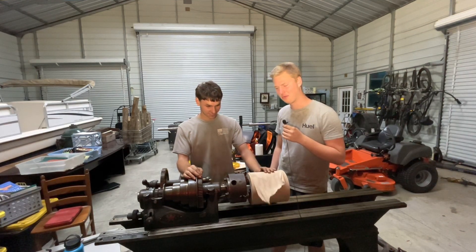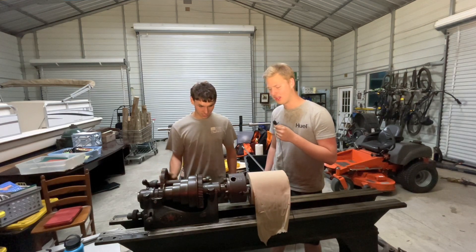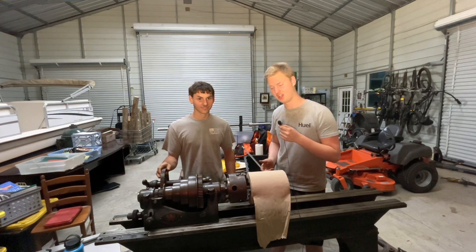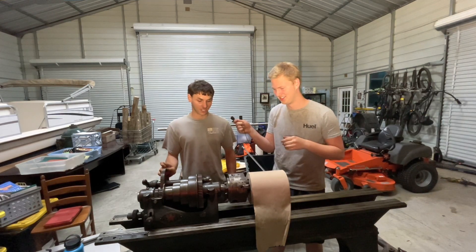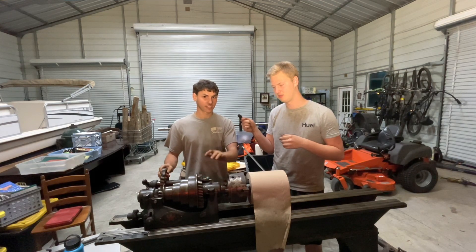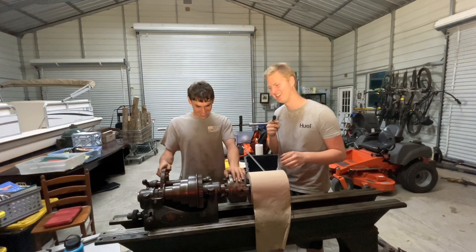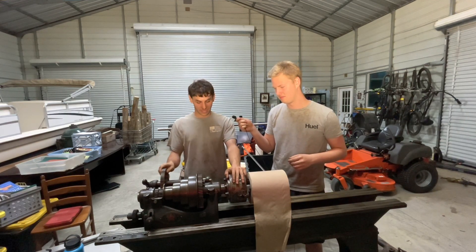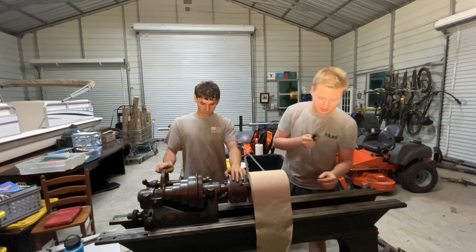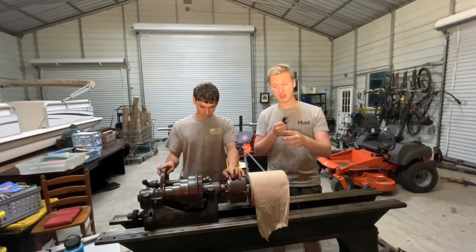This is future us, and we ran into some pretty sad stuff here. There are major issues going on with this lathe. There are no bearings in the headstock — it's just cast iron on the shaft — and the previous owner looks like he didn't oil it whatsoever. So it's either we send it off to a machine shop or we just clean it up and make it usable again.